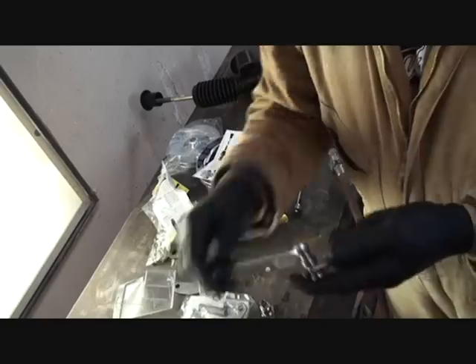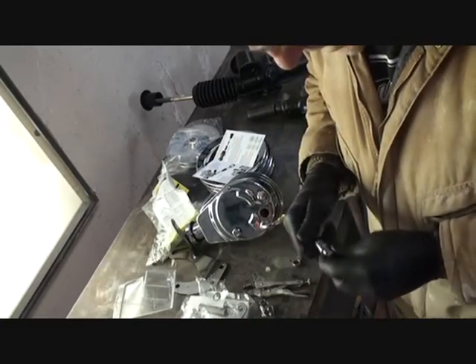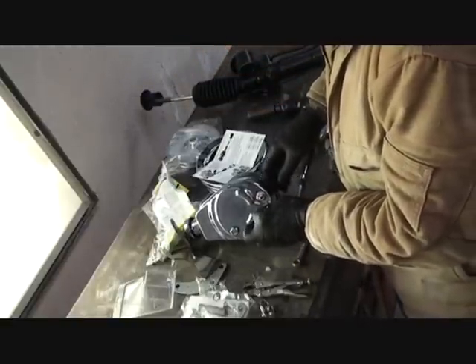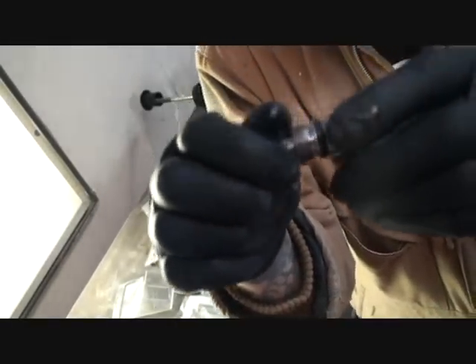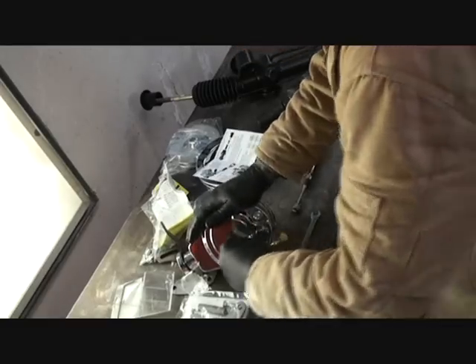I've got my three shims. With the valve standing up straight, go ahead and reinstall our 7/16th nut back on the valve just like so. Make sure there's no trash on your valve, then stick your valve back into the body — make sure it slides in and that the spring is working properly. The o-ring on this brand new pump is good, and our kit actually comes with a new o-ring as well. Go ahead and put the valve back in the pump, bump it on there, and it's done.